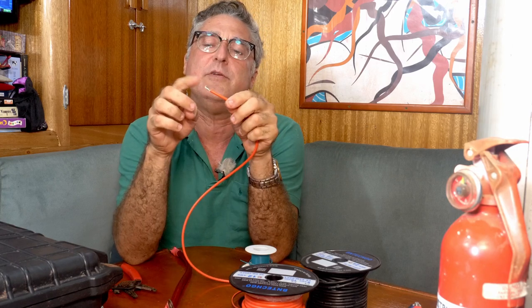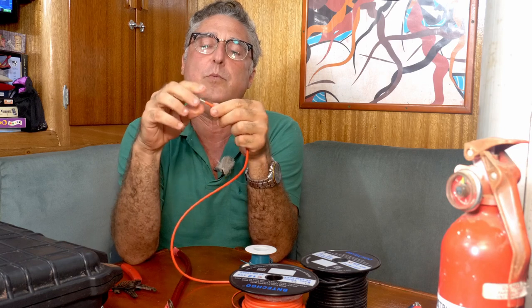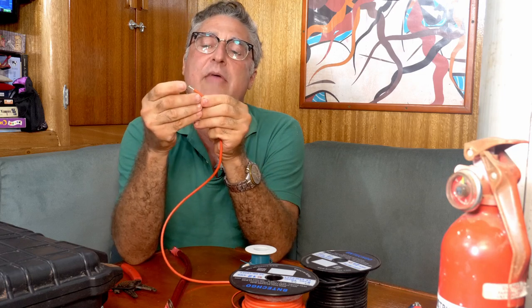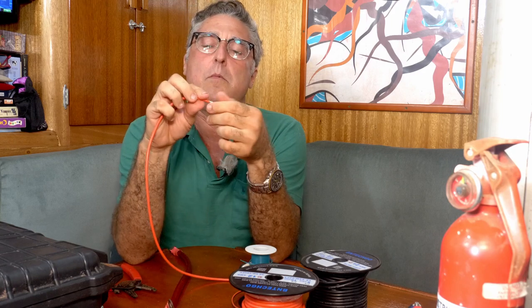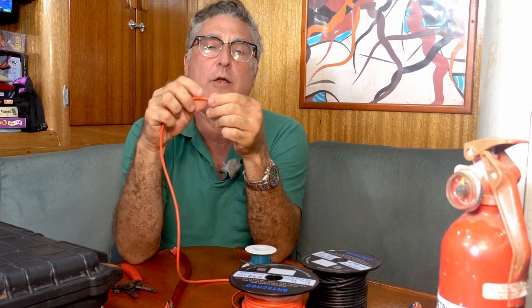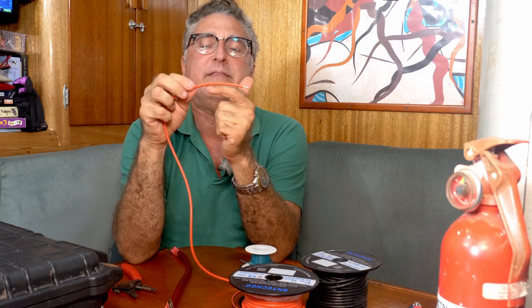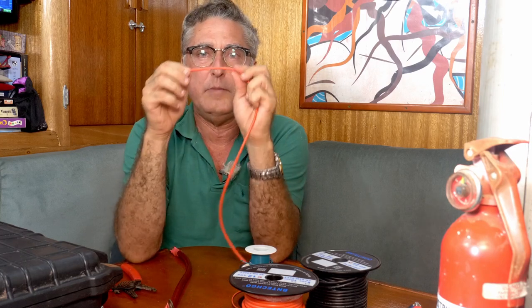This wire doesn't particularly look coppery, but it's pure copper — it's actually been coated with tin, basically dipped in a tiny amount of solder. That tin coating means the wire doesn't corrode as easily as bare copper. A lot of wire used on boats is this tinned copper, and it's worth it. Wire sometimes gets water that'll go up inside it and corrode way up inside the sheath. Tinned wire just doesn't corrode as quickly. Remember, corrosion is our worst enemy on a boat.